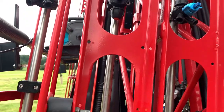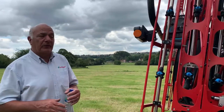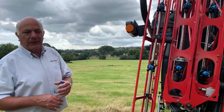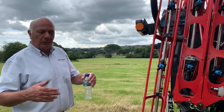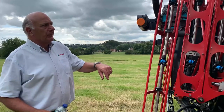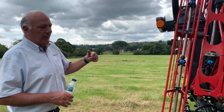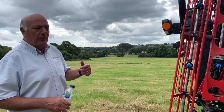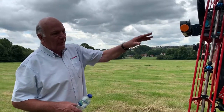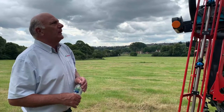This machine has a system called X-Clean that allows us to clean the machine through a series of automatic rinses, or we can do a very simple rinse if we just want to rinse the nozzles. It also has a purge system - if the machine was full of water when we turned on, we'd start with water and then chemical would come to the centre and then spread out across the boom width. With our purging system, using all small bore pipe of known volume, what will happen automatically is we press the cleaning system and it starts to pump out liquid to the centre section, which turns off first, then the next, and the next, ensuring the correct liquid is at the nozzle.